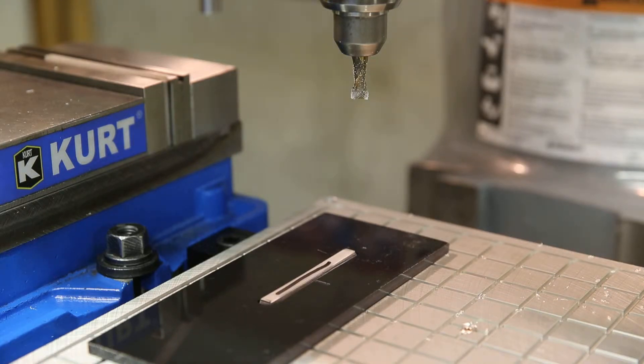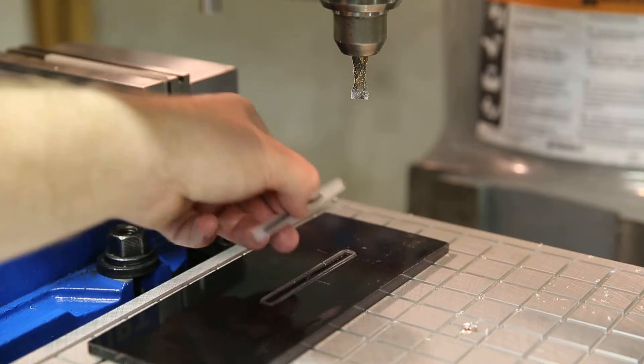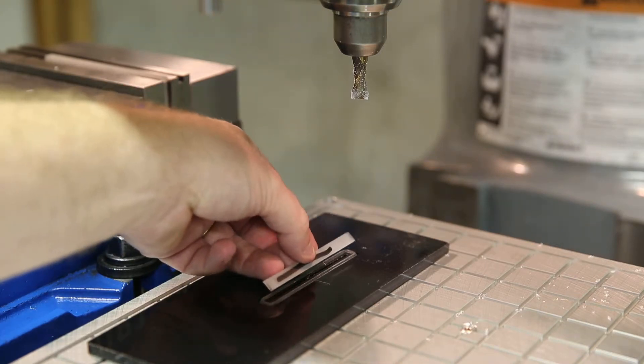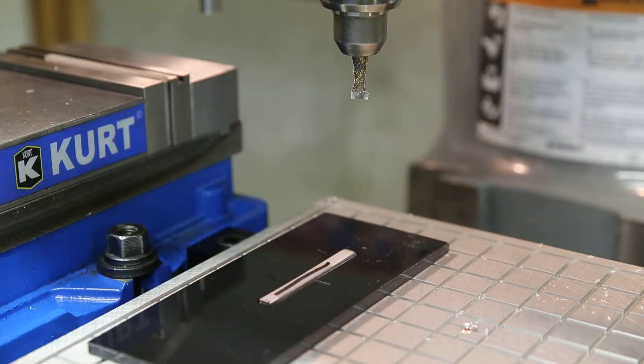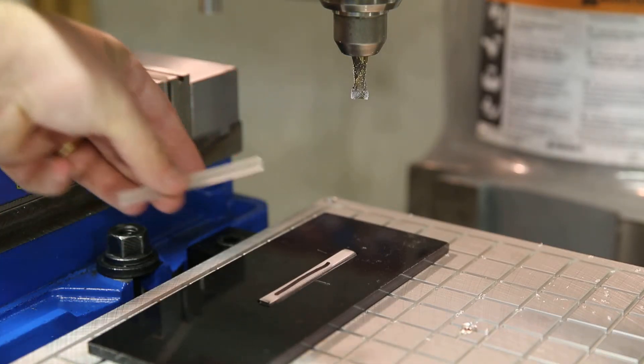To hold these small plastic strips I made this jig — I machined a little slot out, drilled a hole down the middle, and the part just fits right over it. This is the second operation. The first operation was where I put the whole sheet of plastic on the plate and machined all these parts, then broke them out into what they are right now.